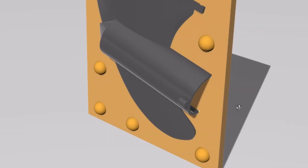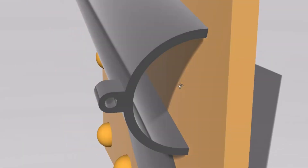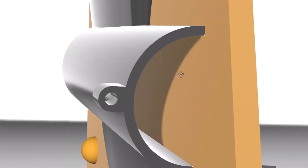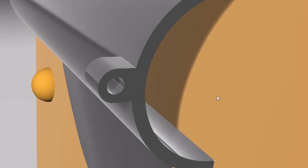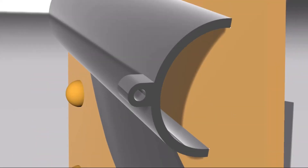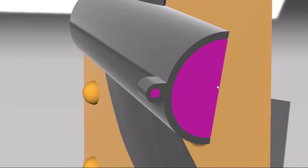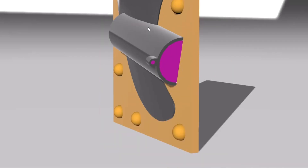The first thing we have to deal with is a slight problem — see down in here? You've got voids. You can actually look down in there where the motor housing is, and this one's a through-hole. So what we want to do is plug all those surfaces. I'm just going to use sheet wax to do that — you can buy this sheet wax exactly for this purpose. It's about a sixteenth to an eighth of an inch thick. You plug up all these holes because you only want to cast this side of the model in this side of the mold.